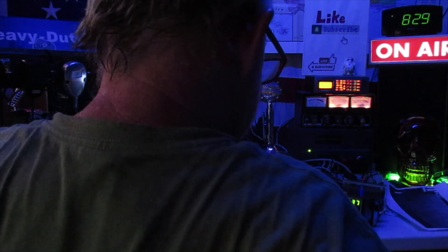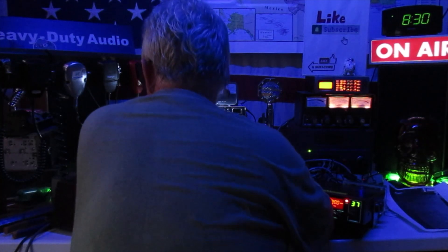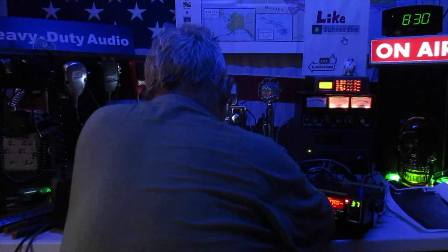Okay, well, it's doing a good job. At times you're peaking up to S9, S7 here. When your signal gets strong and peaks up to an S7, I'm just running a wire dipole in my attic. So you're still hearing me okay even with just a wire dipole antenna inside there. Yeah, QSL — I've got four S-units of noise here, and I've got you four and a half to seven. QSL.